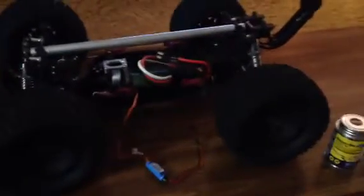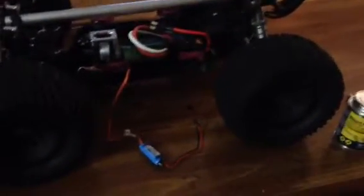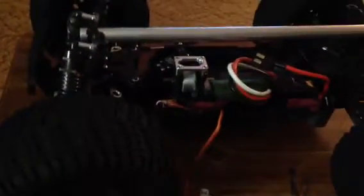What's up YouTube? I'm back again with my MT4G3. I just recently bought a Castle Creations external BEC for my new servo — high torque, high speed servo. It requires 6 volts, well it doesn't require it, but it needs the 6 volts to do the best that it can as far as the ratings go on it.